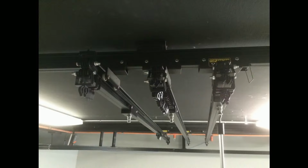This was the roof of my studio. I can't tell you how much easier it was working in a studio where the cables go from every position you have a source up to the ceiling. There's nothing on the floor to stop a wheeled camera or have it bounce over. It is cleaner, and people don't get tripped on things. So whenever possible in any setup, if I have a lot of cables, particularly 3 cameras or something like that, getting things off the floor and up to the ceiling made a huge difference in my career. It was easier to work with and safer all the way around. So if you can, I'd suggest taking a look at doing that.